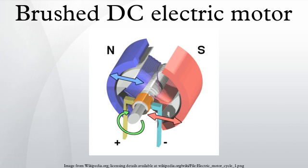Speed control. Generally, the rotational speed of a DC motor is proportional to the EMF in its coil, and the torque is proportional to the current. Speed control can be achieved by variable battery tappings, variable supply voltage, resistors or electronic controls. The direction of a wound field DC motor can be changed by reversing either the field or armature connections, but not both. This is commonly done with a special set of contactors.